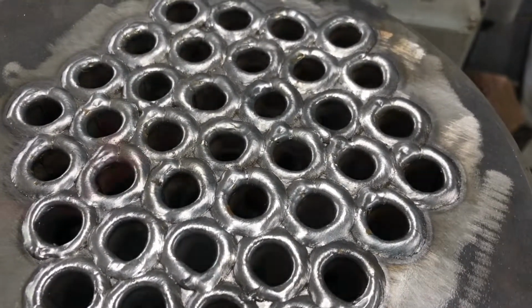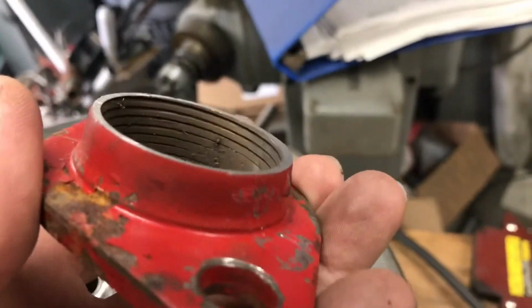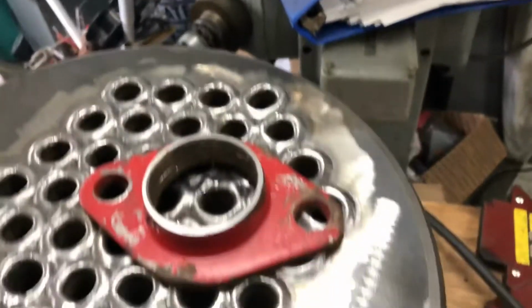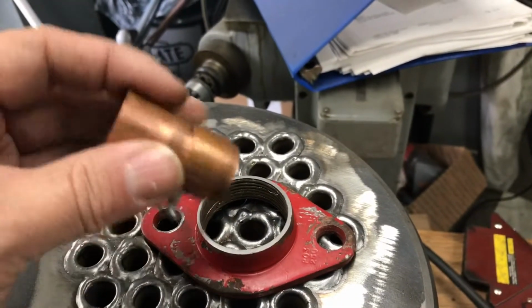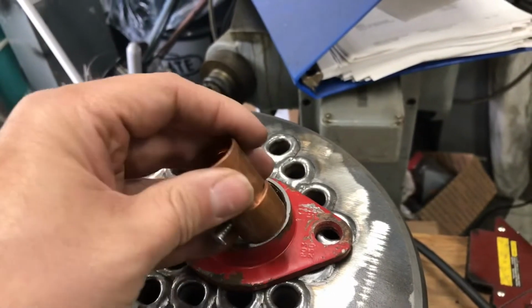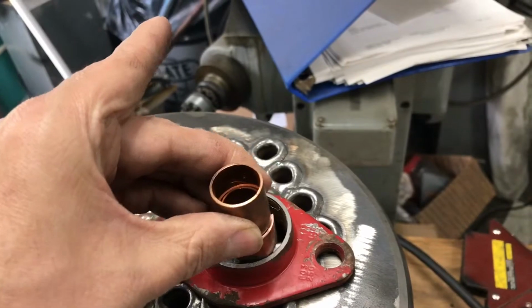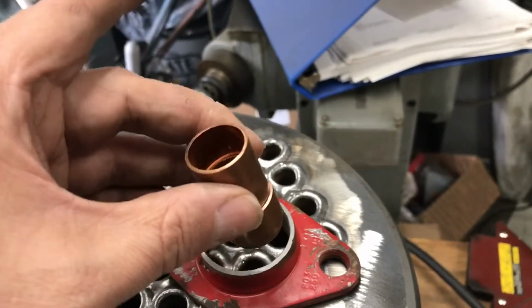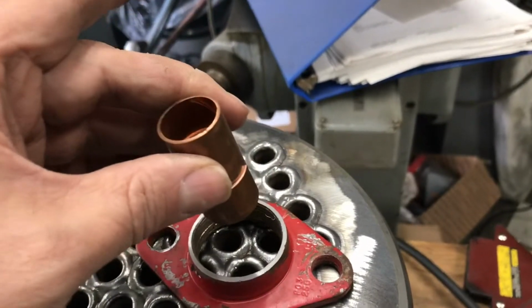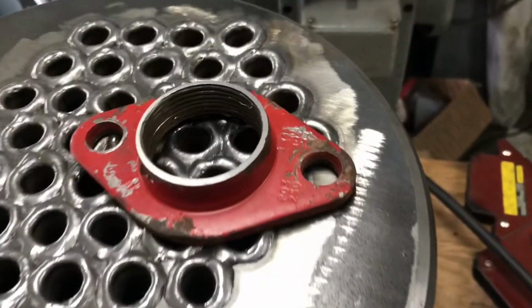What does that button even do? Found the stuff I was talking about. So I took this pipe flange. This is from a furnace project rebuild, and see, I bored out the inside of it just to clean that up, put a nice lip on it. The idea was that this piece of pipe, this was on the end of the MIG gun, and it would ride right on that edge. Let me see if I can lay it in there. There, and it was going to ride the MIG gun and ride around like this. So that gave me my contact tip to work distance was set. I could follow it, and I could follow the line. And it was just outside of the separation between the two pieces. Like I said, that's what I was following. And I'd clamp this down, and I'd go around.